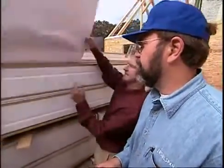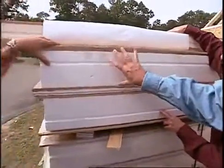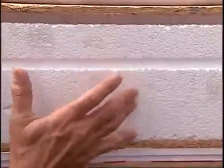Right, we're dealing with large panel sections here, up to 8 feet wide by 24 feet long in one piece. And they're thick. Now these are really thick. Are these for the roof? These are roof panels here. We call these a nominal 8-inch panel because the core will receive a 2x8 when necessary for splines and window bucks. And this white stuff is polystyrene, so what's the R factor we get here?